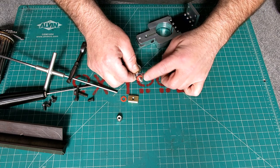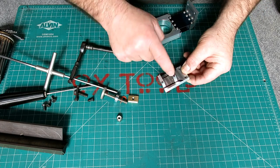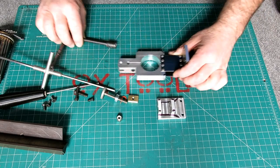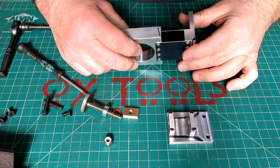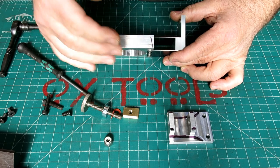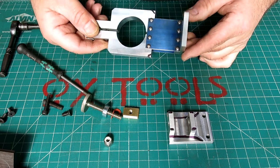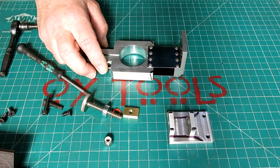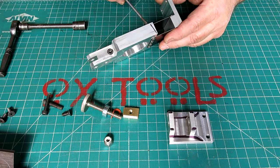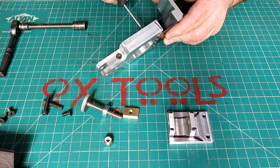So once again, you see the fiber washer there. Okay, pretty simple piece. And what we're going to do is carve some of that away just to make it a little sleeker, knock some chamfers on there. And then this is what we call a parallel flexure here. This is what keeps everything nice and straight and provides some spring return for the unit. And these are just made out of blue tempered stock here. Let's pop these loose here.